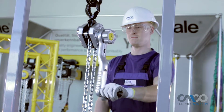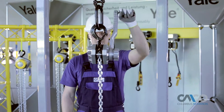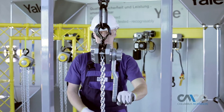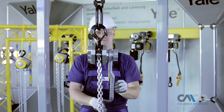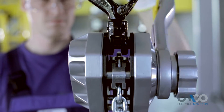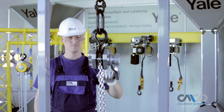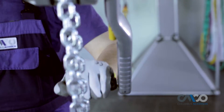When using the crank handle, required pull force can be decreased by up to 30%, helping reduce operator fatigue. If the operator folds the crank handle to the chain side, their hand and body will align with the load chain. This helps reduce the twist effect and minimizes the need for the operator to stabilize the hoist with the other hand.